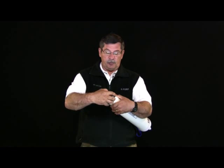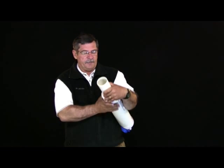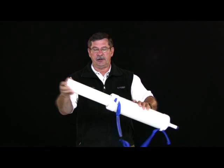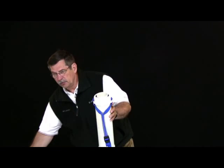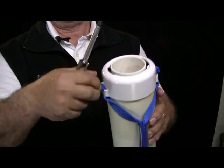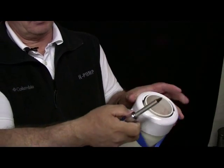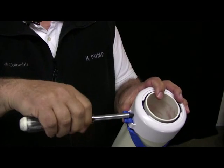The next thing is to remove this cover O-ring, and now you're in the high pressure side of the pump. There are two screws on this side, located right below the tabs that are attached to the pump, so get in there and remove those screws to access this section.